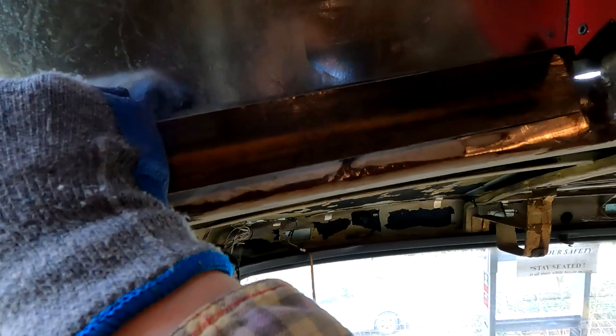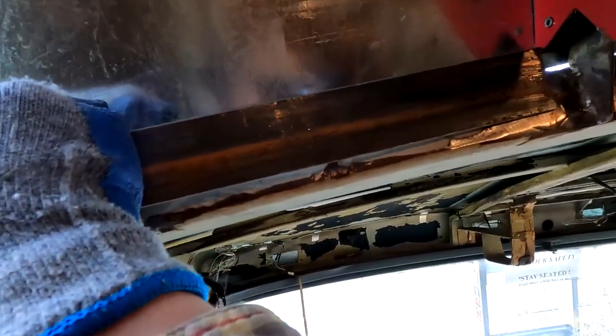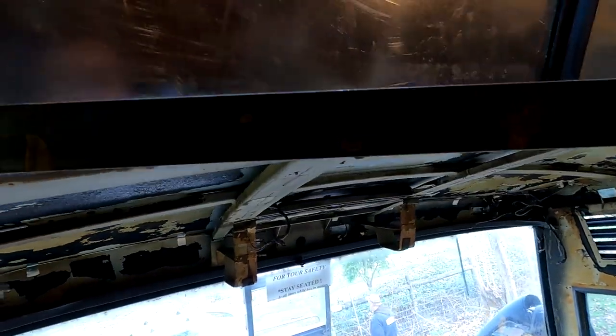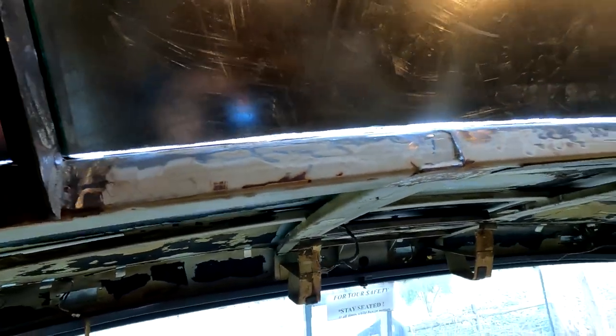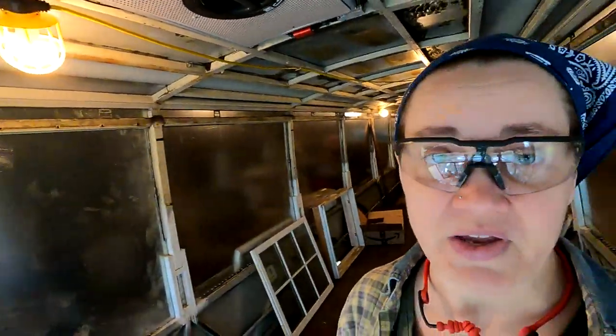What we've decided to do is take a piece of flat bar like this and weld it on to the back as a backing plate when we weld from the other side. We'll tap it in all the way across so we have something to weld to even where there's a gap — it might be overkill, but it feels better than trying to weld the gap closed, which feels a bit sketchy. That's what we got done today. Next time we work on this we'll probably be welding — no more cutting, no more anything else. Progress!